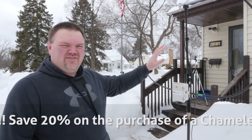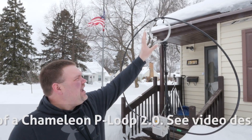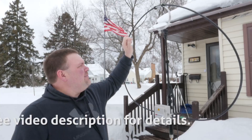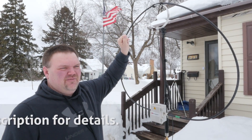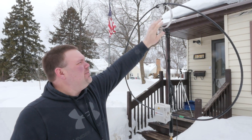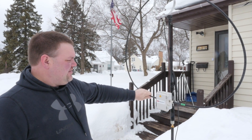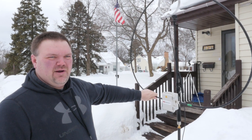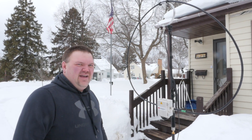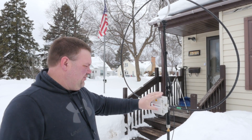It is a mag-loop-style antenna, meaning this small loop is a driven element, and there's magnetic coupling between this loop and the larger outside loop. The magnetic coupling — the same principle you'd find in a transformer — means that when you induce a current in this inner loop, it automatically induces a current through the outer loop. That outer part is what radiates and what we're tuning. Because it's magnetic coupling, it's very inductive.